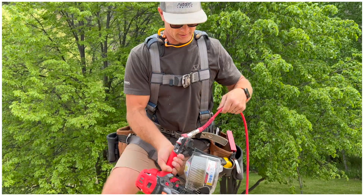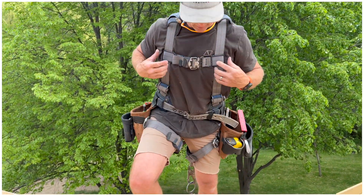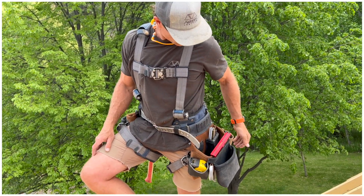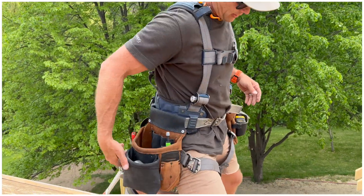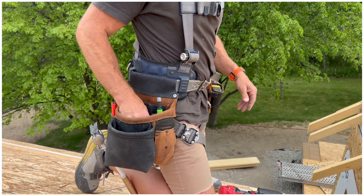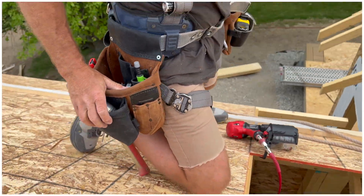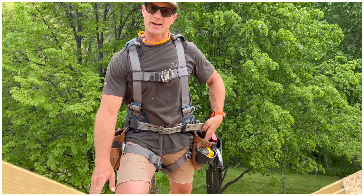The setup I'm wearing is my favorite rig for roof framing. I'm in a Sela ExoFit harness. The bags I'm running: LT bag as my outer bag with tape, nail puller, rafter square, stick nails — 3-inch and 2-inch — my phone, pocket clip in the back. My dominant side is a standard R1 HB: hammer in the back metal hammer loop, no divided interior, full of H-clips. Chalk line in the outer bag, pencil and knife — super simple, light, and I can fit my 2 and a quarter inch coils in the primary bag on my left.